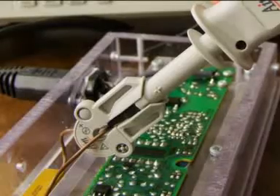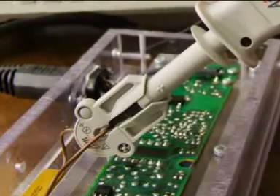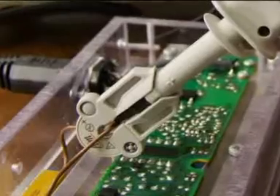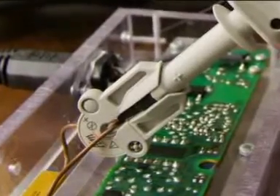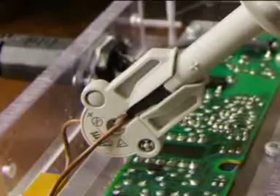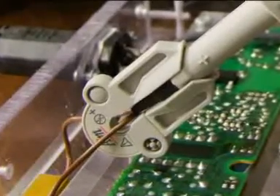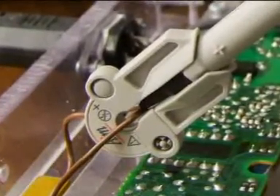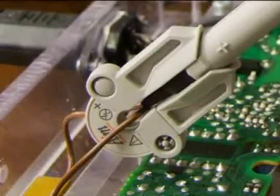As well as acting as a positional probe for PCB tracks, the iProber can also act as a conventional closed-loop current probe. A clip-on toroid assembly is supplied that converts it into a conventional probe when required. In this mode, the iProber has the same bandwidth and dynamic range, but with a greater rejection of adjacent fields.